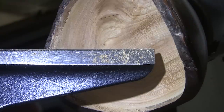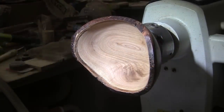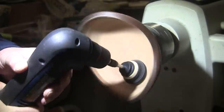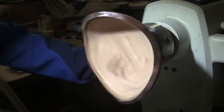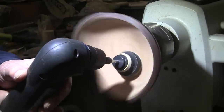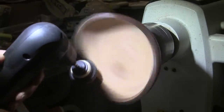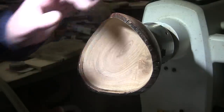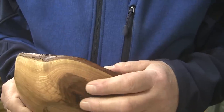Nice. Beautiful grain too. Time for sanding. I'm going to start the sanding at 80 grit with my two-inch disc. I'll have the lathe spinning forward at 350 and then I'll do reverse as well. And then reverse — easy peasy. I'm going to go ahead and put the sealer and shellac on the inside. You saw me do it on the outside. I'll bring it back and we'll take a look at this thing. Be sure you stick around at the end of the video so you can see the before and after shots of this piece. If you'd share the video I'd really appreciate that. Thank you so much.